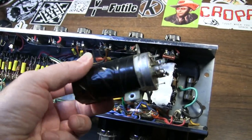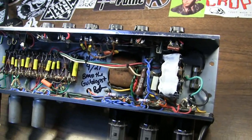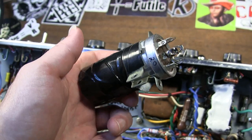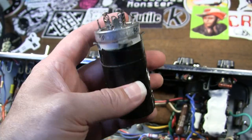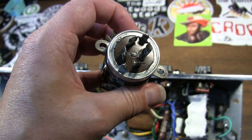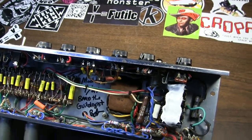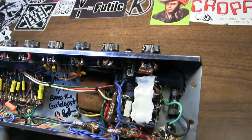So it's a reproduction of the old style can capacitors, on the same equipment that the old stuff was made on. And there's really no reason that this should be bad given how new it is, but apparently it is. It's not bad in an electronic sense, I don't believe, but it's bad in a physical sense. There's something going on inside of it that is causing a physical rattle to manifest and just get worse, and then it propagates itself into the rest of the signal chain somehow, and that's what was going on.